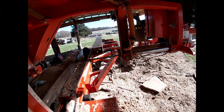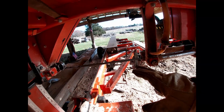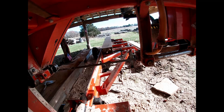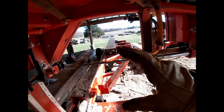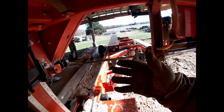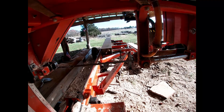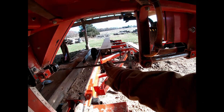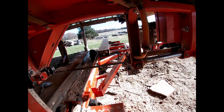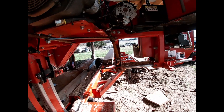By cleaning that blade I know the diesel drip is working because everything I rubbed off will come off once it enters that board. Now, how do you know it's cooling your blade properly? We're going to run through there and when I get to the end I'll take off my glove and lay my finger right on that blade - it won't be hot, maybe warm at most.